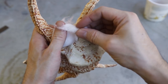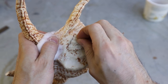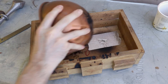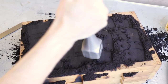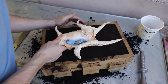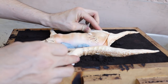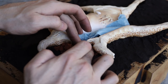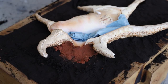Next, I temporarily plugged the holes with cotton and then started making a sand mold for the shell to sit in. I used an oil-bonded metal casting sand called Petrobond because I already had it, but really any sand would work. This reddish sand is just fresh unburnt Petrobond, which sticks together more easily than the darker burnt stuff. I used it to create little dams which helped the shell hold as much metal as possible.